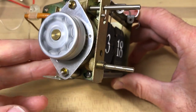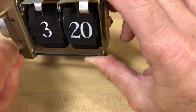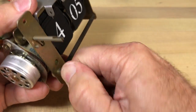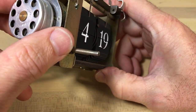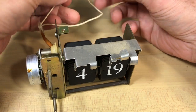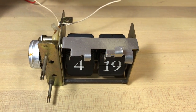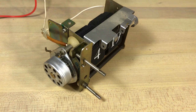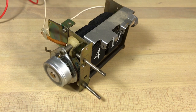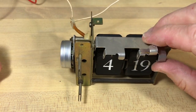The motor and wheels are turning smoothly, which concerns me because that points toward something more difficult to fix than I wanted. When I power it on it comes on immediately, which is great — we know electronically the motor is working fantastic. But something's wrong and it's going to be in the gearbox, which is always a challenge.